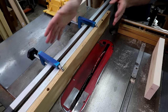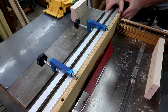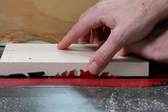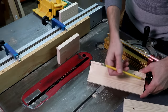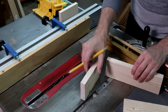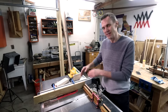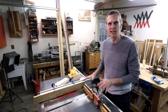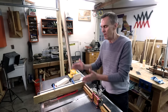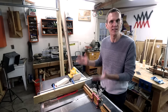The first thing you want to do is clamp a board to your rip fence. This is a sacrificial fence and it'll let you come right in to your saw blade without damaging your actual rip fence. Lower your blade down to half the thickness of the board you're going to cut — it doesn't have to be exact but I like to get as close as possible. I'll cut the rabbets on the ends of the two longer pieces so the short pieces fit completely within the rabbet, meaning the width of the rabbet needs to be three-quarters of an inch. You'll be using both the miter gauge and the rip fence together. Since it's not a through cut, this is a safe method — never use both in combination for cross-cutting completely through a board, because that invites kickback.